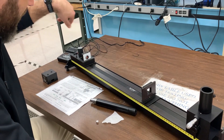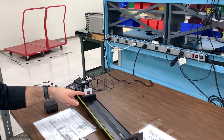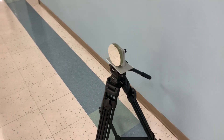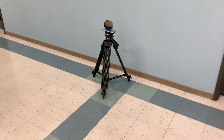The idea is the beam goes from this rotating mirror, hits that fixed mirror, and then comes back and lands again on the rotating mirror exactly where it left from. We adjust the fixed mirror using the two screws on the back in order to send the beam right back to the rotating mirror. Using a tripod-style stand is best because it makes it really easy to adjust the mirror, adjust the height, and move it to get it where it needs to be. The tripod stand does not come with the kit, but it is a camera stand that you can find.